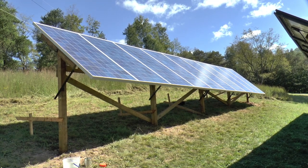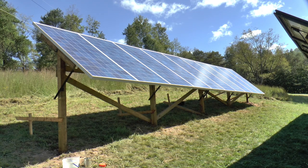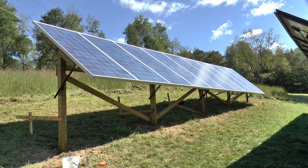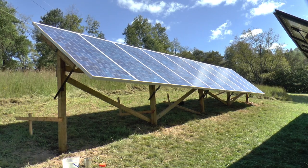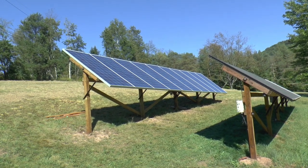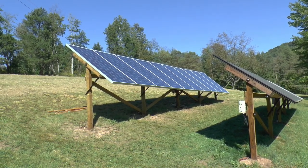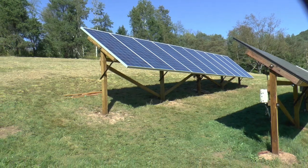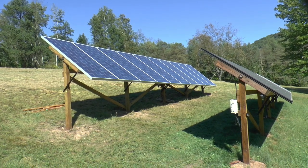I've got a lot of wire, and I've got to get a combiner box mounted and get the cables run up here to it — so that'll be the next thing. A couple days later, I got the number four wire run all the way from the controller up to here, and got it all wired in and it's all working. This morning I've seen 2.1 kilowatts coming out of her.